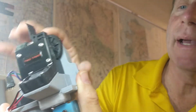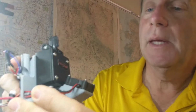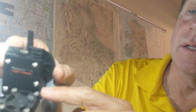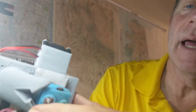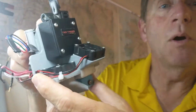It's a 3D printed bracket in 2 pieces. It holds a geared extruder and motor. It's got an E3D V6 hot end in there, complete with a custom mounting location for the heat break fan. It's got something really important that the old printhead didn't have, and that is a part cooling duct and fan that's built right into the printhead. I've even put in a little translucent window with some LED lights so that it lights up the area that's being printed. All in all, I think it's a much better printhead than the original, and I'm hoping that this gives that printer another 5 years of life or so.